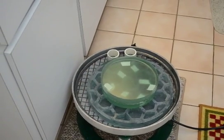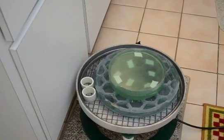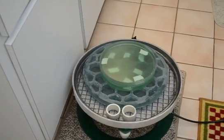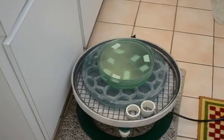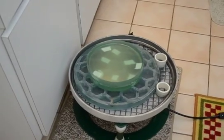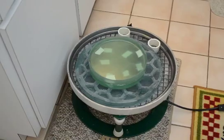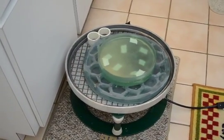The two little pieces of PVC pipe are in there to prevent the blank from stalling out in any one particular spot. As they bounce around off the bumpers on the side and off the blank, they keep it moving, so it circulates throughout the entire pan and wears the pan evenly. They seem to work pretty well — just a couple of short pieces of PVC pipe thrown in there.